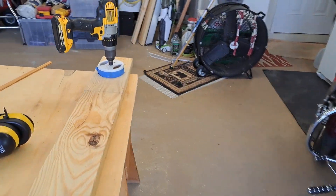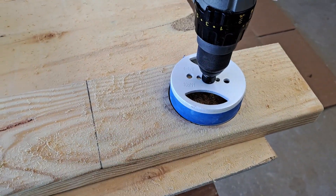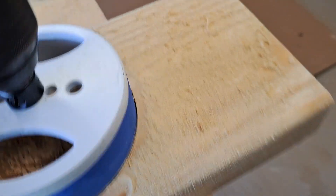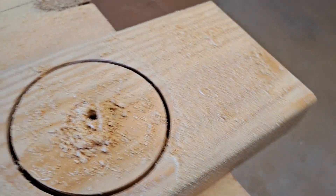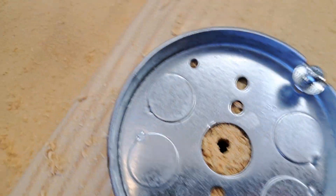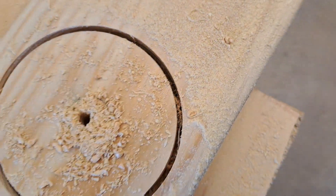I got my pilot hole done. I didn't cut my piece off because I think it's easier to work on a longer piece than a shorter piece. I taped my depth and made sure I went all the way to my depth all the way around it. So here's my ring right now — obviously there's still material inside here, but here's my ring and there's where my junction is going to sit.